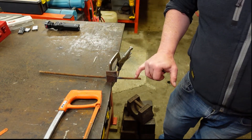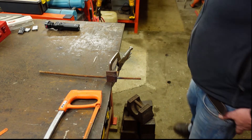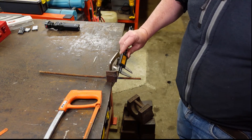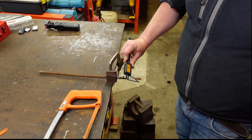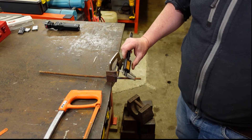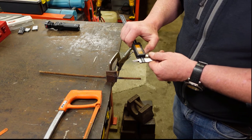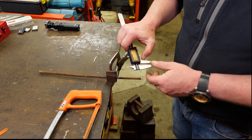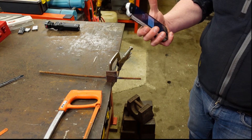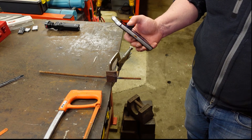Now what I'm going to do is take out the foam and put the timer on it, and I'll just cut through this bit of rebar here. I'll grab calipers and check what size that rebar is. Okay, that's 8.14mm so that's 8mm rebar — and in imperial for our imperial friends that converts to 5/16 of an inch, just to give you an idea. So we'll set up the timer and run through how long it takes.